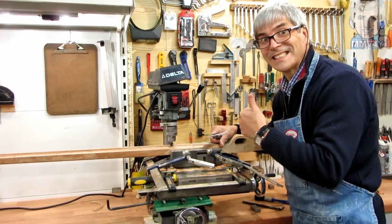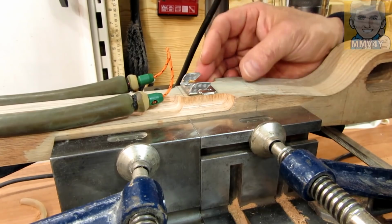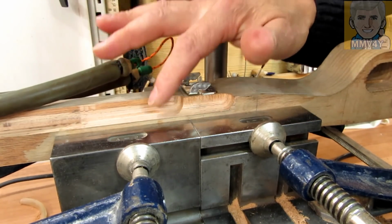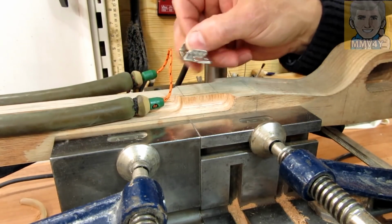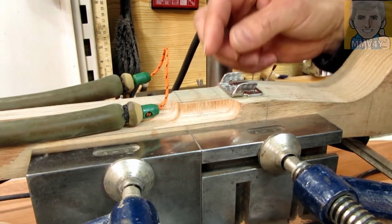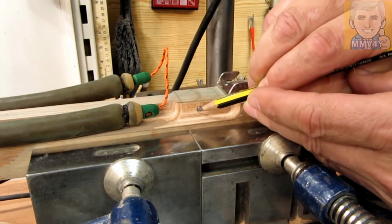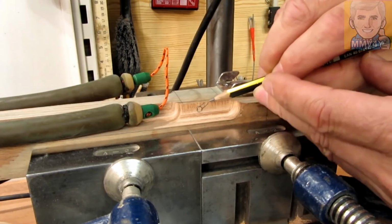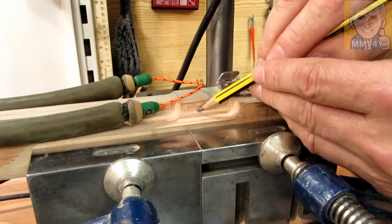Looks good. And like I said before, one thing leads to another, and here's one more situation of that happening. Once I finished cutting these slots for the rubber bands, I now realize that I don't need to use this piece as the Dyneema anchor, because I can make the Dyneema anchor right here just by drilling a hole around here and then cutting a slot at an angle, and that will guide the line towards the lowest point.